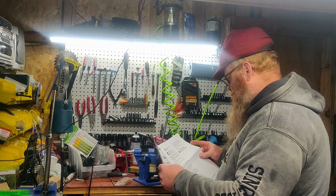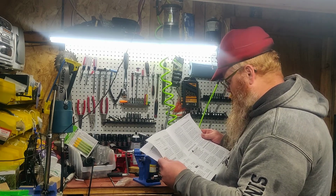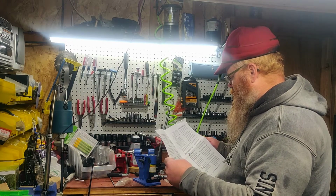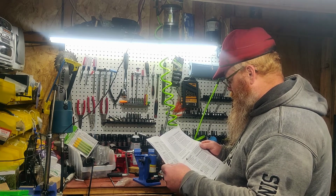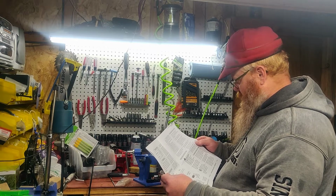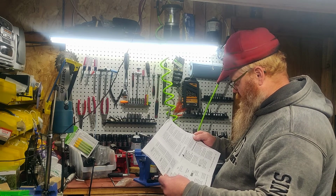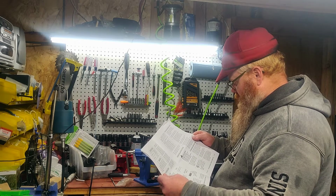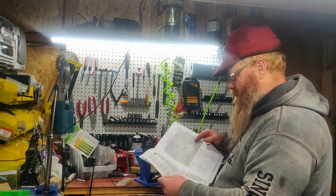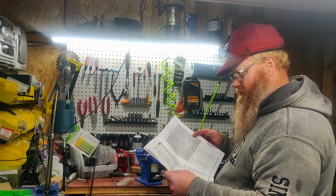Let's see these instructions. To break the chain, fit anvil, okay. To spin the chain, select either the large or small spinner and thrust dies. Insert into sleeve, thrust handle, always use a matched set of dies, don't mix. Apply a light amount of grease to rivet, insert rivet into place and loosely spin the chain. Okay. Rotate the handle clockwise until okay.